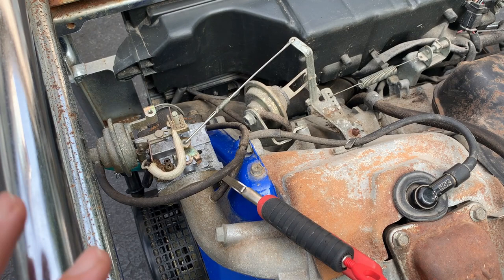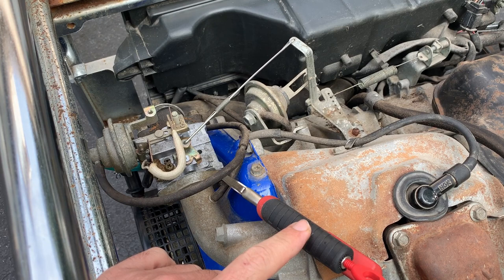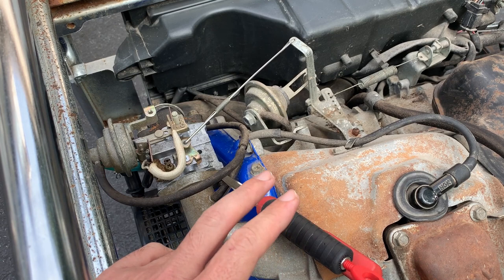Yeah, it might be a vacuum leak. So with the line pinched off, it didn't actuate the choke. So when I pushed it manually, the engine sped up real nice. I took this off and it stalled. So maybe a coincidence, maybe not. I'm gonna try this one more time, let it run a little bit longer before removing these clamps.